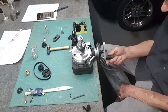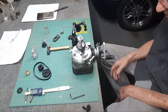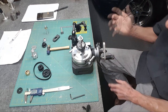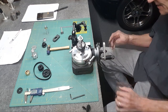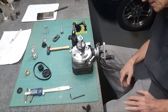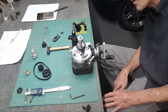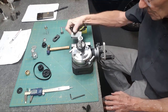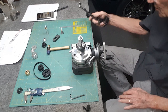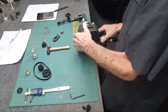It's a pain — I've spun this thing a million times, so it's not going to fail on me, but you've got to spin it four times to get five degrees. I had to redo the T-nuts because they were too far down — when spinning, they'd suddenly hit something and jam. The T-nuts are now thinner, and because they're thinner, when you put them in you've got to use a ruler to hold them up so the screws engage. I'll eventually make two more T-nuts and pick up some longer screws. Now it's ready to finally make a timing pulley.